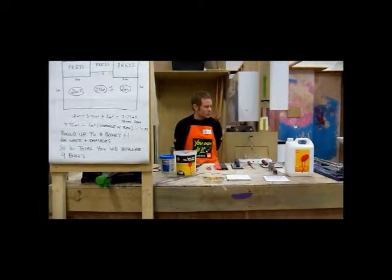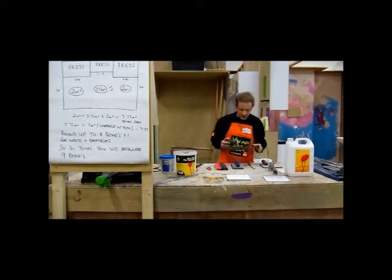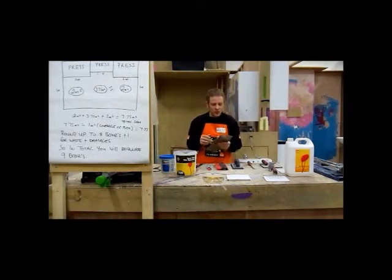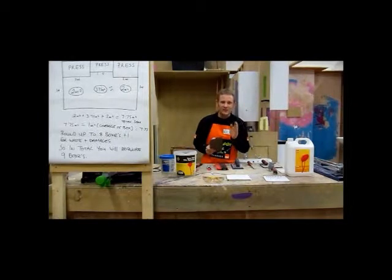The first thing I'm going to go through is walk you through the various types of tools you're going to use. The first tool I'll introduce you to is the actual wall trowel. This is probably the single most important tool you're going to use for the job. How do you know it's a wall trowel? It's very simple — the notches are quite small and quite regular in spacing. The trowel ensures that you actually apply the exact correct amount of adhesive to the wall, so you don't apply too little or too much, and that will make sure the tiles lie in an even plane across the entire wall.